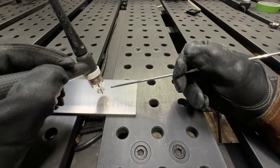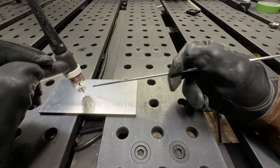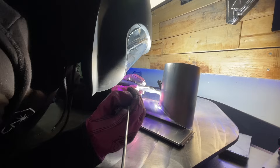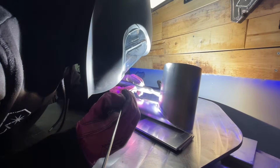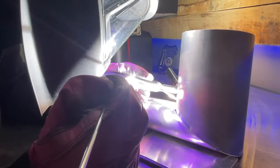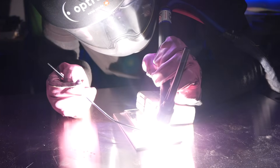Make sure you don't advance your feeding hand at all. Have it relaxed in a position and feed with whatever grip feels most comfortable for you. This way in the future, no matter what project or weld you're doing — even welding around something tricky — your filler material hand is going to be trained to stay out of your way and stay ready to feed. Sometimes you can actually feed around a corner with a bent filler rod. No matter what the situation, the goal is that you can feed your filler material confidently and comfortably in the real world.